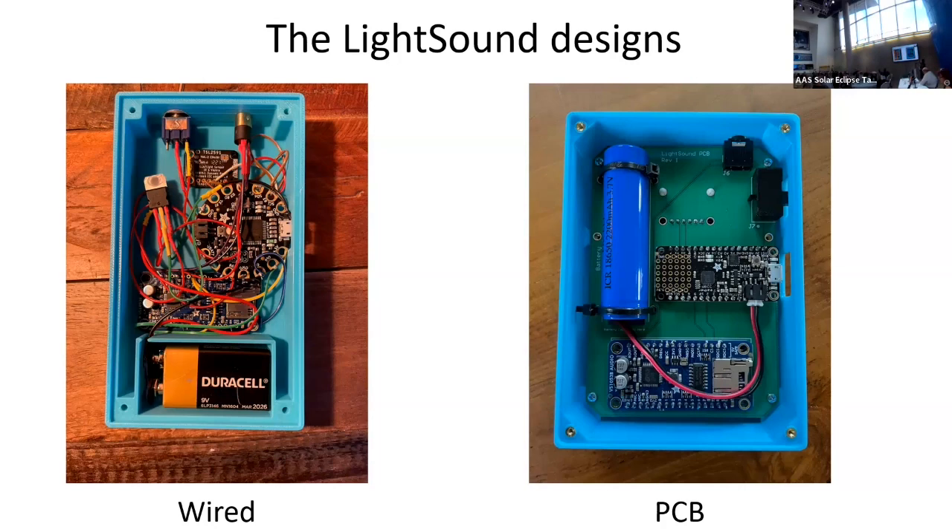For those interested, the circle part in the middle — or that long top one — is the microcontroller board, where the code exists. The light comes in through the light sensor, goes through the microcontroller board, gets mapped to the MIDI board where the sound gets mapped to an instrument. Bright light goes to a flute sound, then a clarinet, then a low clicking sound.